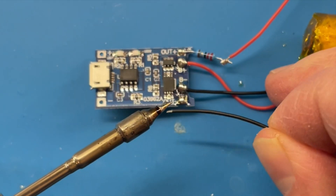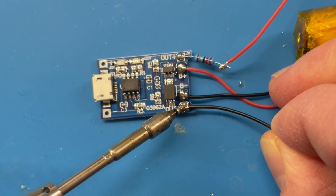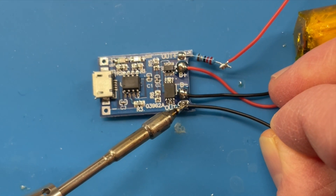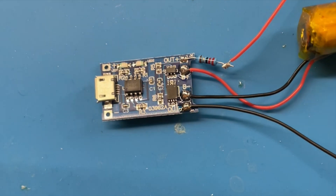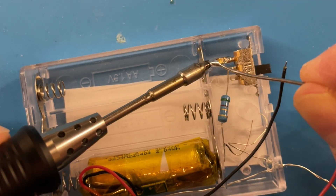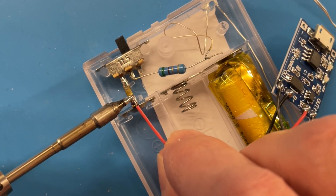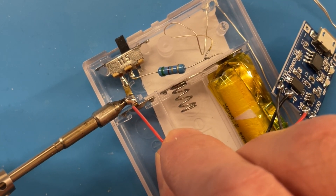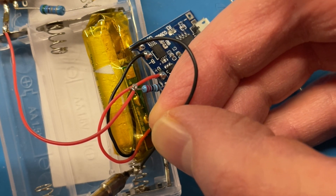It's pretty easy at this point to add in an extra resistor. I'm using a 20 ohm resistor which will take our total value up to just over 25 ohms. Using our previous voltage drop we'll now just be drawing 26 milliamps, which means each LED will be getting about 0.44 milliamps. Our battery life with a 500 milliamp hour capacity should still be around 20 hours or so, so we're not really losing anything.